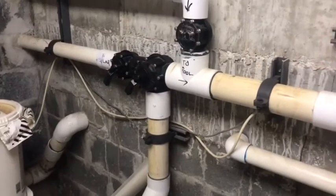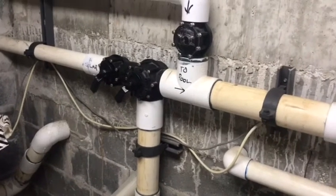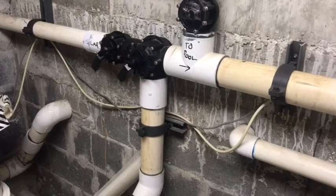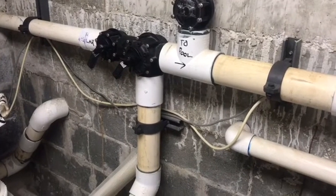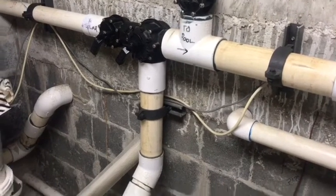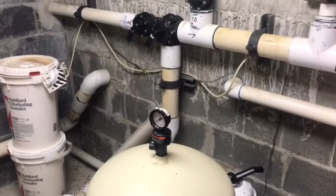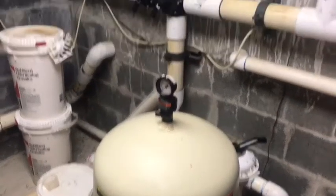One of the things you can do if you're worried about your filter having holes in it: when you backwash, you can shut the return valve off so that the water doesn't return to the pool. If there's a hole in your filter, all the dirt will come flowing back through. To keep the pool running good, if you know there's a hole, shut the return valve when you backwash and the debris won't return to the pool. When you recharge the filter with the DE, you may get a little DE flowing back in, but your whole pool won't turn green, and you can return before the next service to change the filter elements and keep the pool looking good.